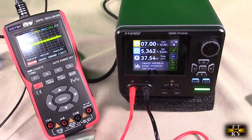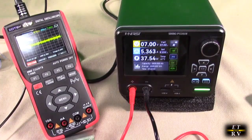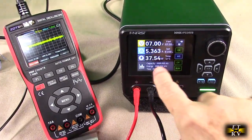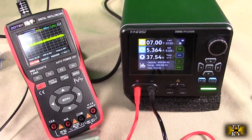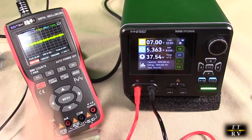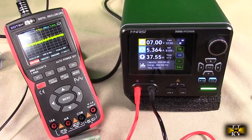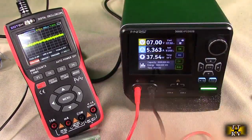Here's an experiment for the noise, or the ripple. I have it under load — about 5.3 amps — using that load resistor. You can see it's turning about 37 watts at 7 volts. I have an oscilloscope right there, and you can see it's got a really small amount of ripple at that load. So that DC voltage at 37 watts is producing a very clean DC signal.